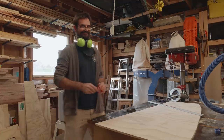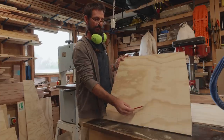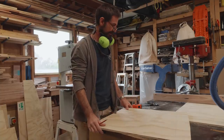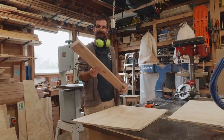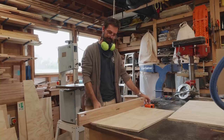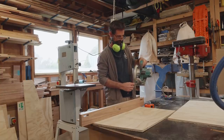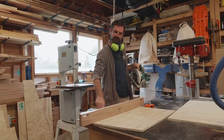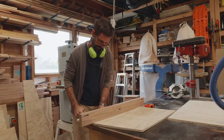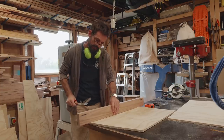Is that geography or geometry? Geometry — I'm a sailor, I need to know geography! I've labeled it 'port up' — you can't put enough labels on things; you can look at that jumble and get pretty confused. For the plunge cut we need a nice fancy fence — circular saws are usually marked 40 millimeters from the edge, and you can set a fence from a distance of the line you want to cut and run along for a nice straight cut. You want something firm to butt the fence up against rather than just a pencil line.